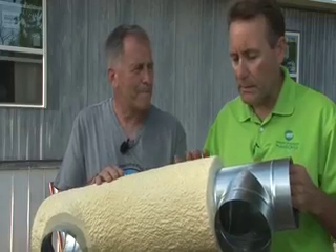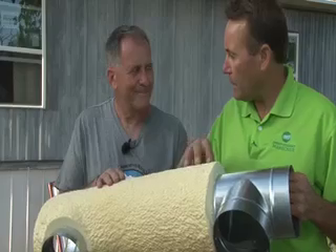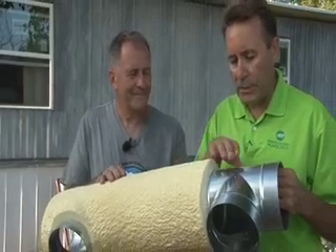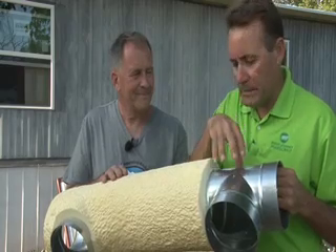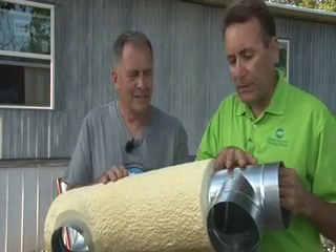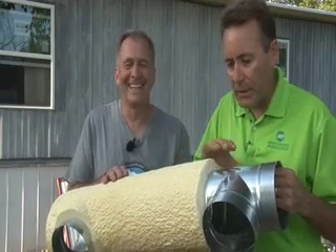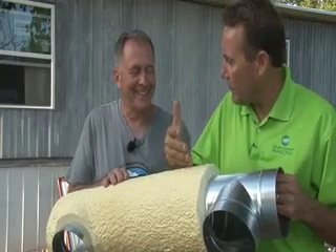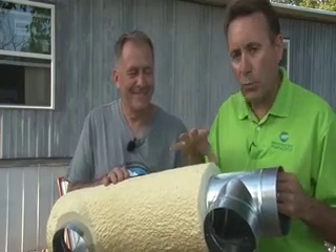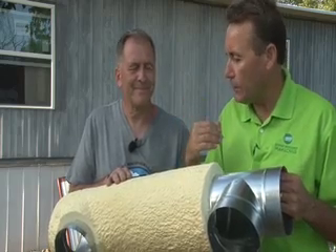When I first saw your product, it was at a model home in Northwest Arkansas, and something that all energy auditors know when it comes to ductwork: one of the major flaws is it's seldom sealed properly. If a contractor's been up in the attic and they sit on it, trip over it, or lie down upon it, it becomes separated, and then we have air leakage. This home had up to one ton or 400 cubic feet of air flowing under the crawl space.